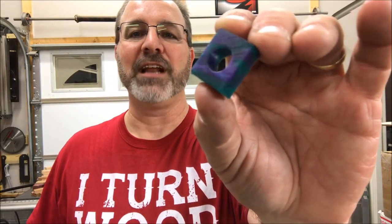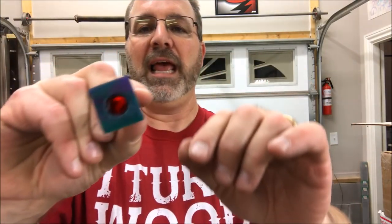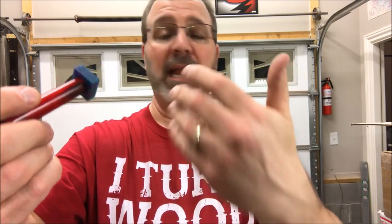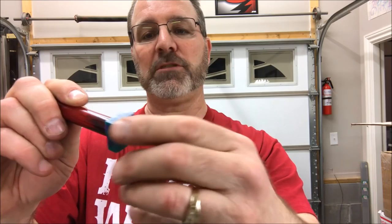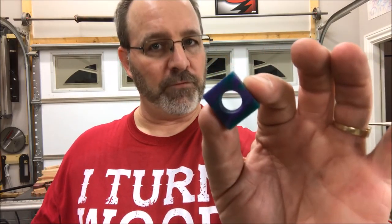I really hope you enjoyed this video. Here's another quick shot of the little piece I made — I really like it because it very easily threads onto the end of my pen and I can tap right down the center without any interference. You might be asking why I left it square instead of truing it up. I could have, but I thought it would be nice to get a good grip on it and have a little more meat around it for as much support as possible. I'm really happy with it, and I can't wait to start using it — hopefully I'll save a few pen body tenons.